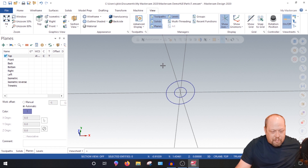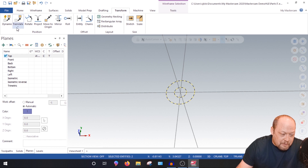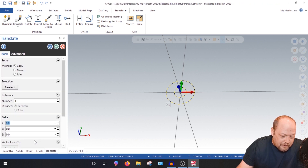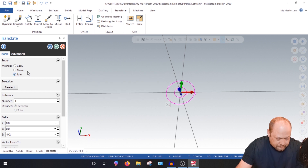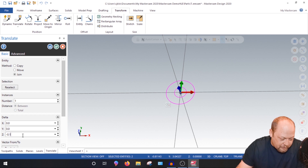I'm going to show you how I design in Mastercam. No one else designs the way I do, but I'm a real-world guy who actually uses this. I'm going to grab these lines and extrude them down. Go to Transform, then Translate. On the Z axis, I'll hit down twice and come over here — I think they're about 100 thou — I'll make it 125 thou, then hit Join.